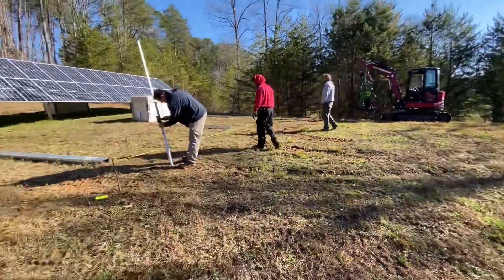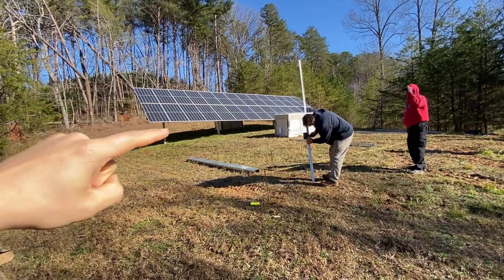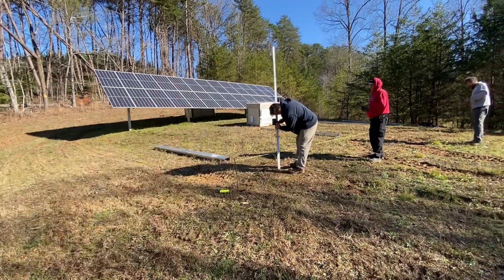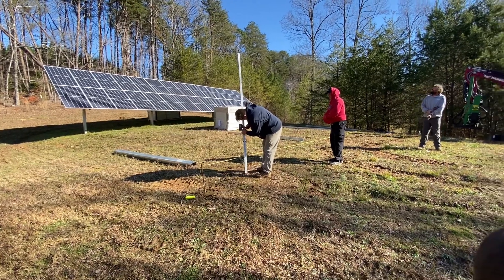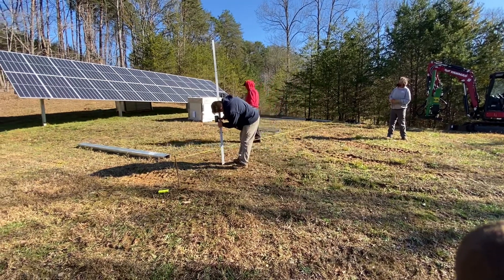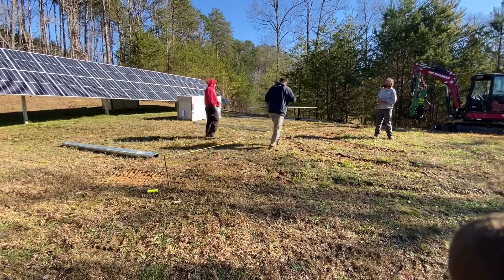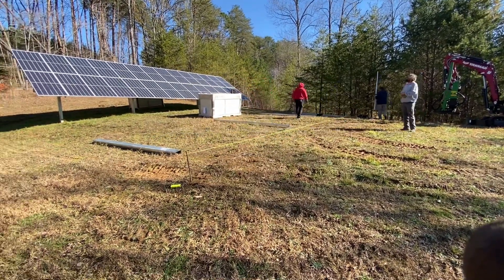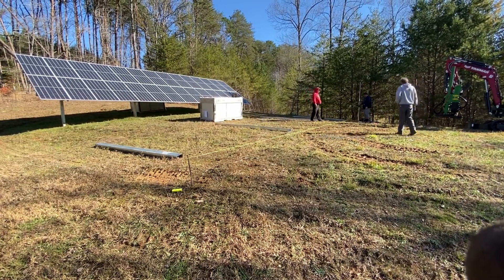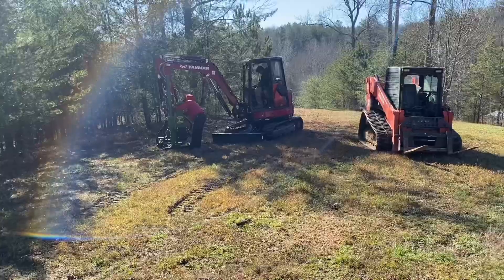The laser is essential — we're setting up the laser level, which is essential for getting your posts perfectly level. It's really important that your posts on your solar array are all plumb and level, and their rotation is really close. That's just going to make it that much straighter. There's lots of adjustability built into the Sinclair, but if you can build it straight from the get-go it's really helpful. For residential ground mounts, our acceptable tolerances are a lot tighter because we still care about aesthetics.